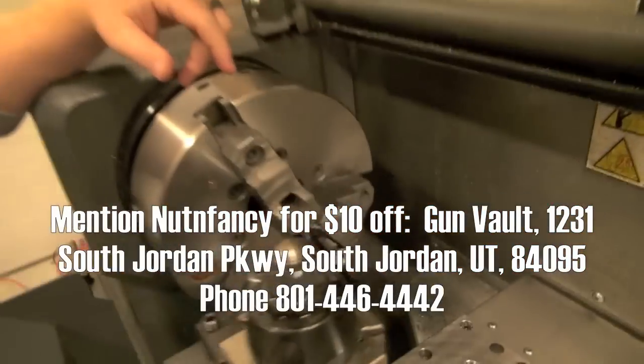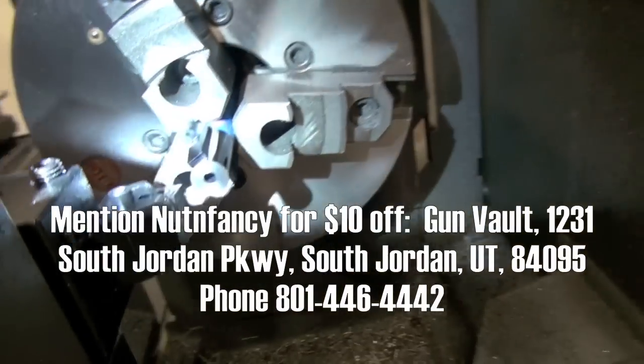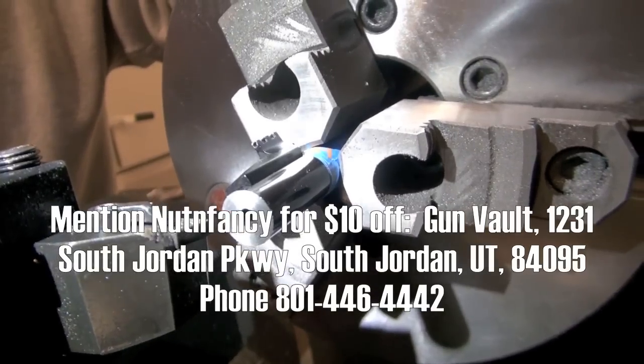So what we've done here is we've already found the center of the bore, so we put a rod in and we dial in off the center of the bore. This one was pretty far out. You know, we're using a three-jaw chuck here.